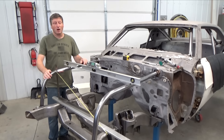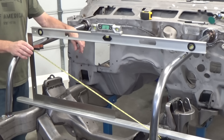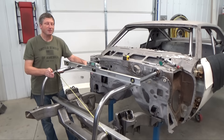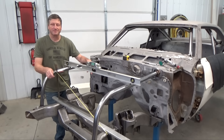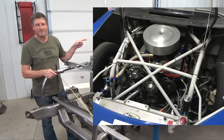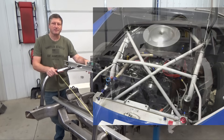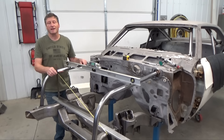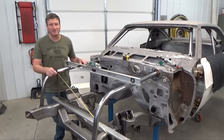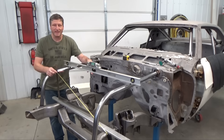After welding, all my measurements still check the same. The bars aren't quite finished yet — I'll be making a set of additional spider bars, but I can't do that until I get my mock-up engine installed. Spider bars are a series of diagonal bars that triangulate the front end and eliminate any frame flex, which is important because this car uses a big, heavy sway bar. A flex-free frame allows the suspension to work properly under severe loads, which we plan on doing quite regularly. Next time on Real Garage, we design and build a custom aluminum oil tank for the engine.